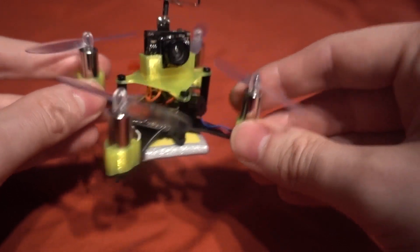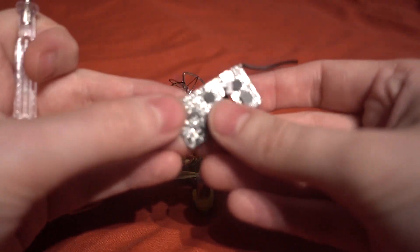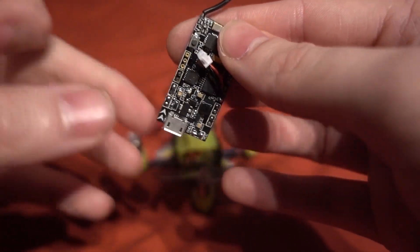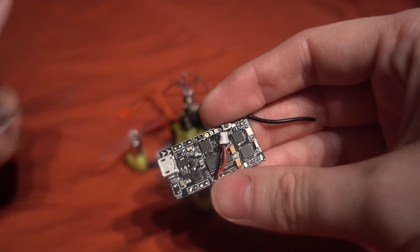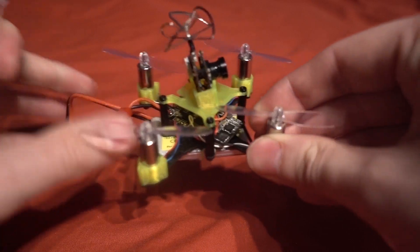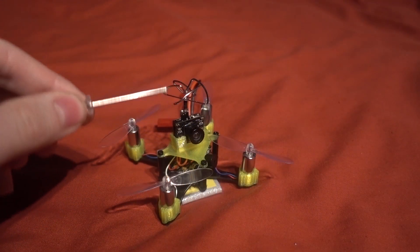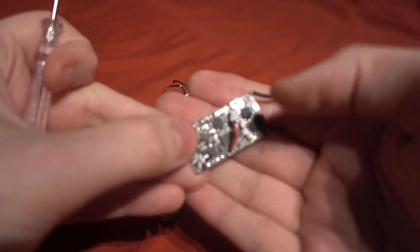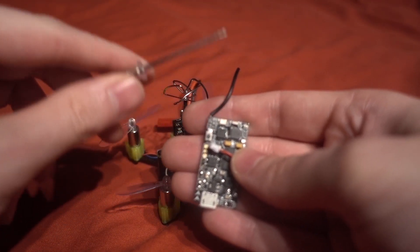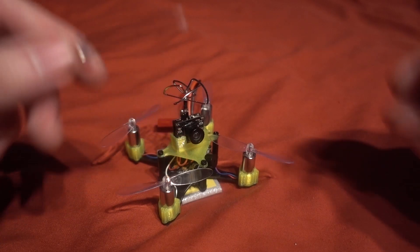You're probably thinking why am I using a Flysky version of the board — full disclosure: I first installed a Frsky one and one of the FETs malfunctioned. I flew it once, gave it one punch out, and all of a sudden one of the motors started spinning on its own when you plug the battery in — that is a characteristic of a FET burning out. The Frsky version was working really well because it also transmits RSSI data back to the transmitter and on-screen display, but the Flysky one doesn't — there you go.